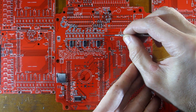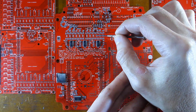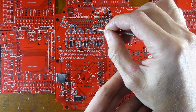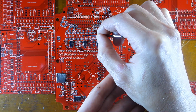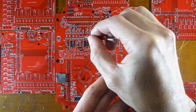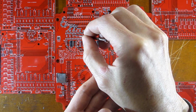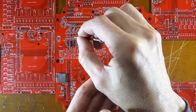The double Schottkys is where it started getting difficult. Basically you've got very little room to put the glue between the 3 pads, so you have to be super accurate with glue placement. Then the glue strings, and you don't want one of those strings to fall on the paste because that'll stop the leg touching the paste. And you don't want to put too much glue down that when you press the part down it pushes the paste out of the way. I'm probably being overly pedantic and making it sound harder than it is, but better safe than sorry.